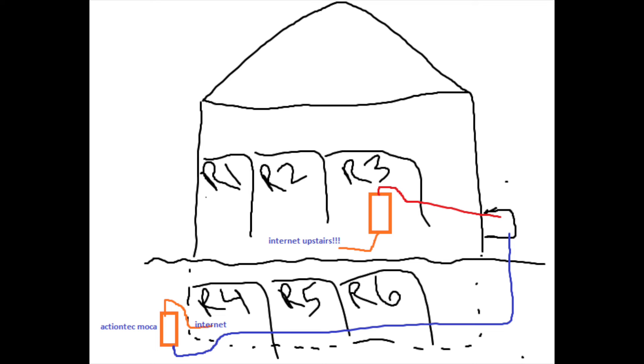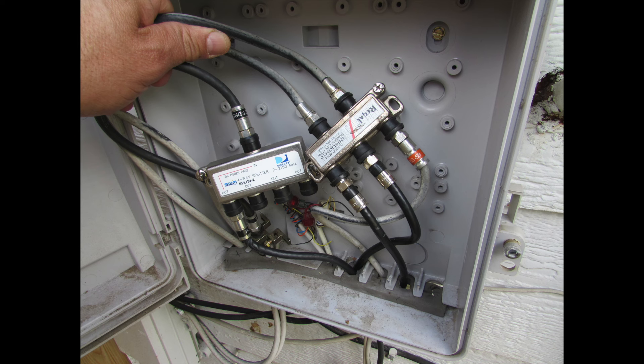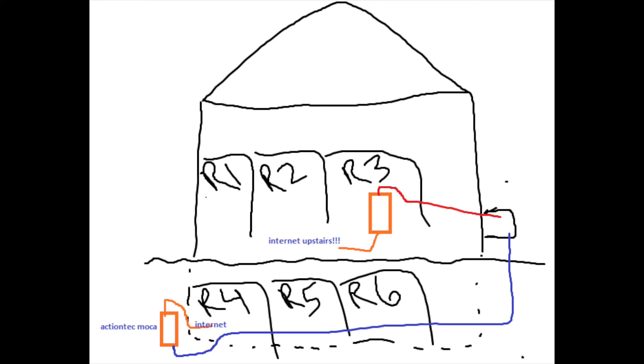You should always check your cable box because some cable companies will disconnect any unused rooms in the house. So if the rooms you are trying to connect are not both on that splitter, you'll need to make sure that you hook up those rooms so they're on the same splitter, because that's our common connection point. Now that you understand how they work, let's look at my real world example instead of these diagrams.